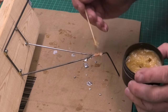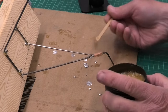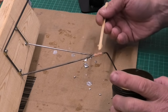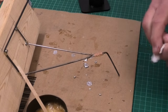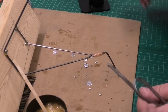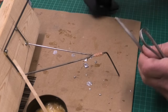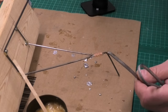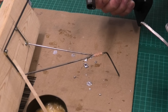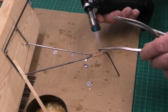We've got both legs bound up with the wire now and I'm going to solder them. The trick to doing this so it looks neat is to get the wire nicely tightly bound from the start, then plenty of flux so it's all nice and clean. I'll put a link to the flux and blow lamp I use in the description. The trick is to get as little solder as possible, just enough to coat everything - no big blobs. If we do get any we can trim them off with a knife or file. As little heat as possible.